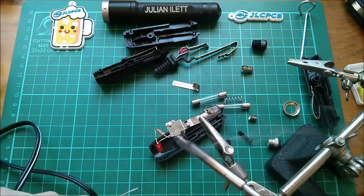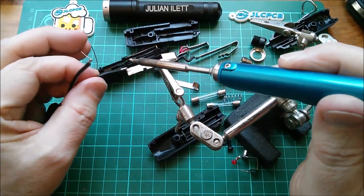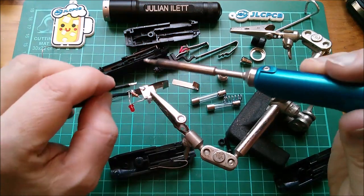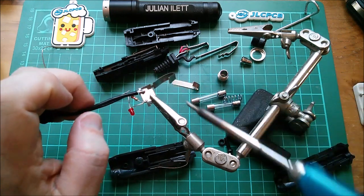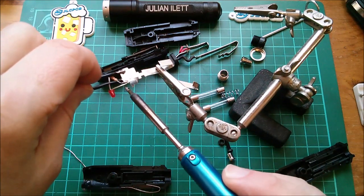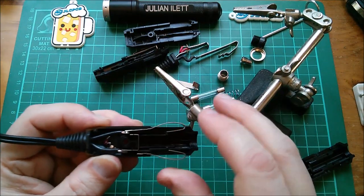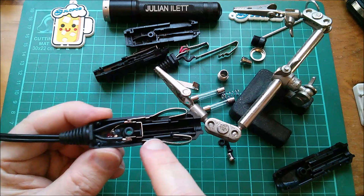That soldered quite easily, and I don't think the heat got over to there, so that's fine. I soldered neg — which doesn't have the white stripe — to this piece. That's gone on nicely, and POS onto here. Ouch, that's getting extremely hot — interfering with the plastic molding. Can I tack this LED leg back on there without it all falling apart? Yes, quite possibly. That's all gone in really quite well. Push that LED in. So that's POS, which should be white stripe — yes it is. Neg on the outside, although only one of these is actually connected; the other one is just a dummy. That's a bit naughty.